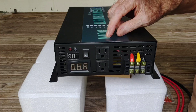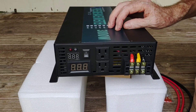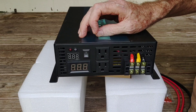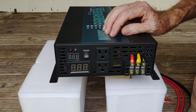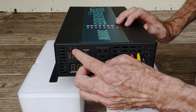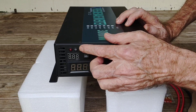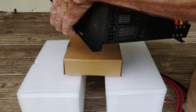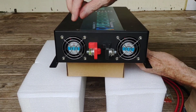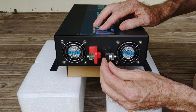The other thing I really liked about this is it has a 0.8-amp idle power draw, whereas a lot of the other inverters I was looking at had two to three amps in idle mode. I didn't want to be drawing that much power just sitting idle, so this has a very low idle usage — something I've always aimed for. Of course there's an on/off switch that lights up, and a voltage warning display. In the back, this thing weighs a hefty eleven and a half pounds.